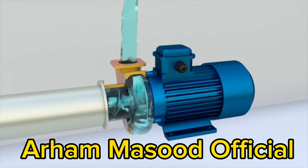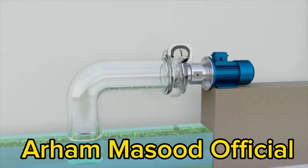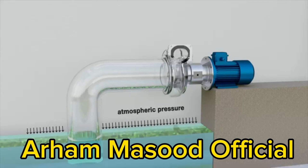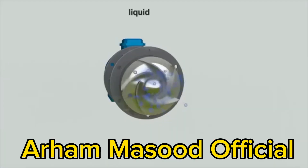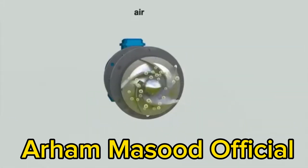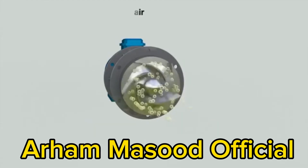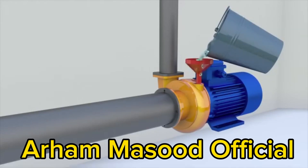When the pump is running, liquid flows continuously into the pump casing through the suction nozzle. But what happens if there is no liquid in the pump — for example, when the pump is first switched on and the casing is empty? For the liquid to fill the pump, the pressure in the casing has to be lower than atmospheric pressure; then atmospheric pressure will cause the liquid to fill the casing. To reduce the pressure, some air has to be pumped out. An ordinary centrifugal pump cannot do this, because particles move due to inertia, which depends on mass. The mass of air particles is much lower than that of water, so it is impossible to pump air at the speeds a centrifugal pump operates at. For this reason, centrifugal pumps must be primed before switching on, either through a special channel in the casing or through the discharge nozzle.